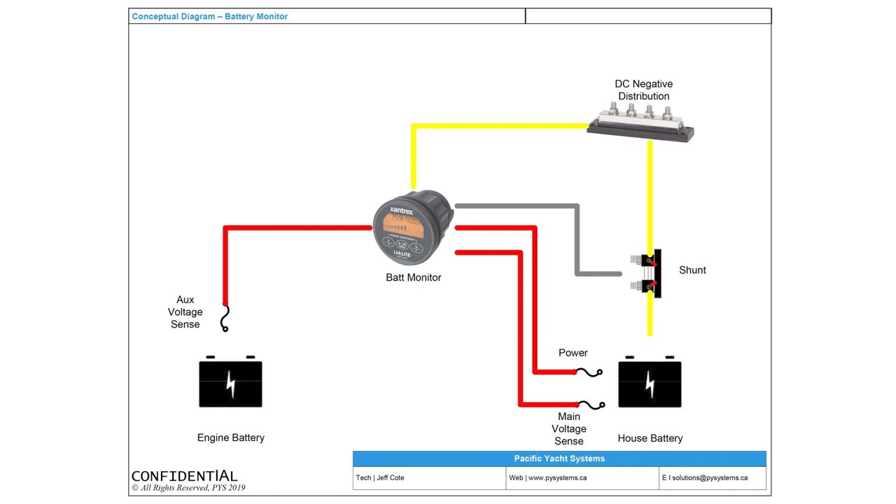But where are we going to put that shunt? As Brian suggested, if you connect both battery negatives together on one side of the shunt and have all loads connected to the other side, your battery monitor would effectively be looking at the battery bank capacity of your house and starter as one. You really don't have two battery banks — you only have one — because all loads are common to the shunt. The only way to individually measure the amp capacity, amp draw, or charging going to each respective battery, as Brian asks, is to give each a dedicated shunt.